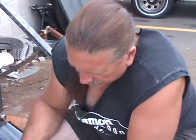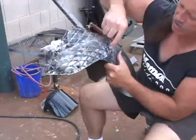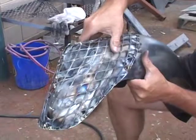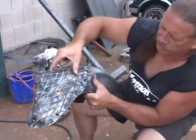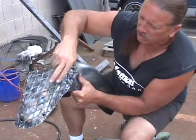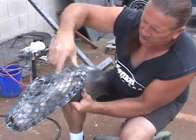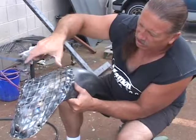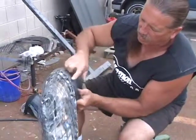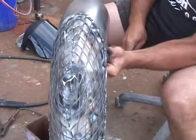What I've done is welded three nuts onto the backside with small allen head screws in three locations on this fender to hold the netting on. This will allow the person cleaning the bike to remove the netting by taking the three small screws off and clean underneath when it's all painted up. It'll also allow me to paint underneath. This way it'll look like the net's part of the unit, and yet it's a bolt-on unit. We'll mold it around this area to give it a smoother transition so it'll look like it's actually molded right into the fender.